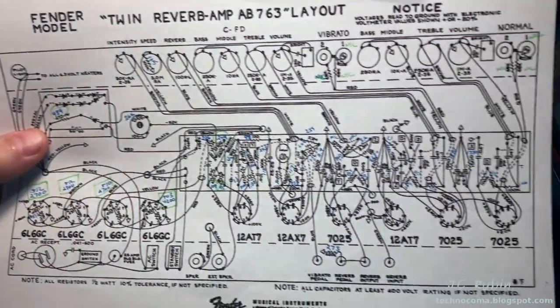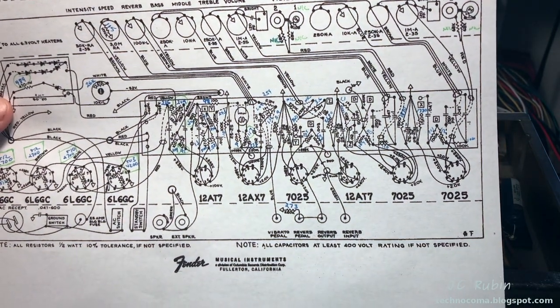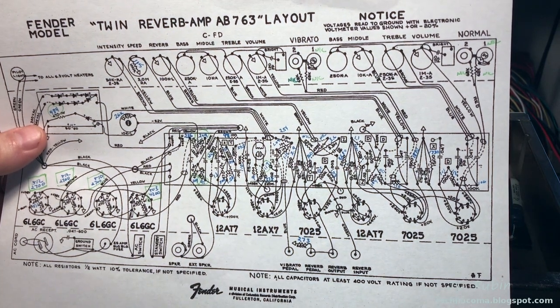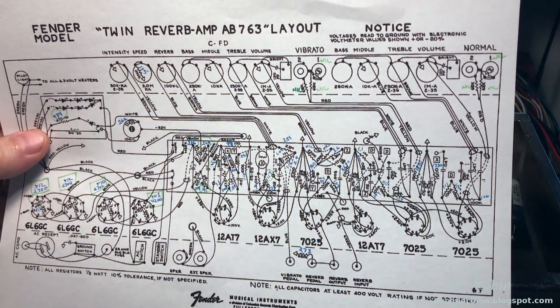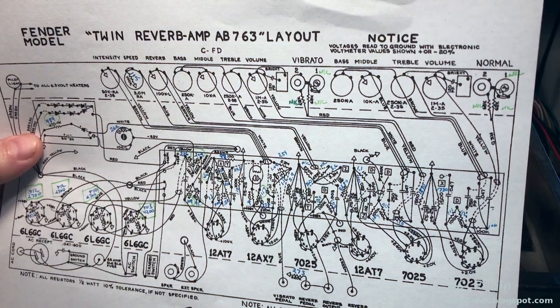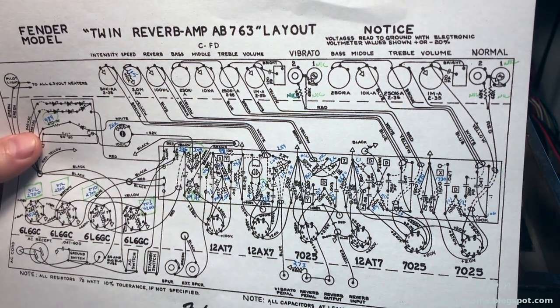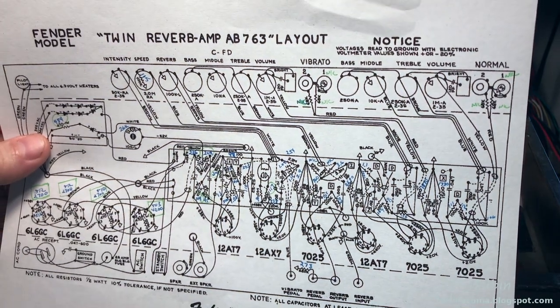So I just wanted to point that out as well, because that is an important part of doing all this: taking a look at these resistors. Or else, you do the capacitors, you say, yeah, just needed a recap, you go and you fire this stuff up, and then you spend God knows how long trying to solve for all the millions of gremlins.